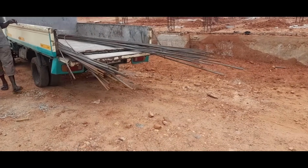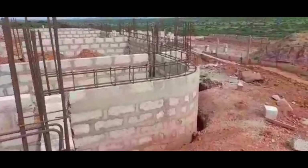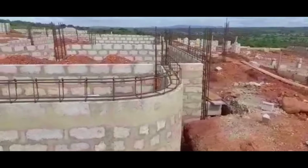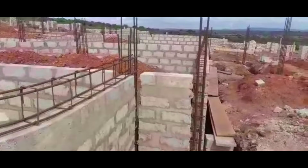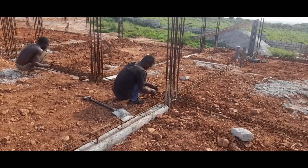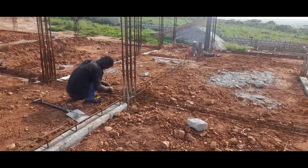In the last stage of the foundation build, which was in video 2, the steel binders laid iron rods along the perimeter wall of the foundation, which was casted in place prior to the filling of the foundation chambers to form the ground beam. But in this instance, these iron rods will be casted together with the floor slab to form ground beams within the foundation.